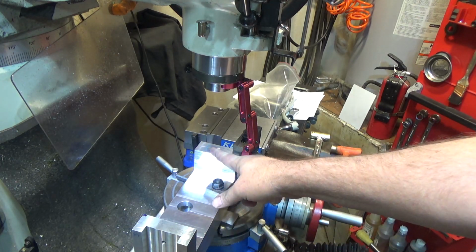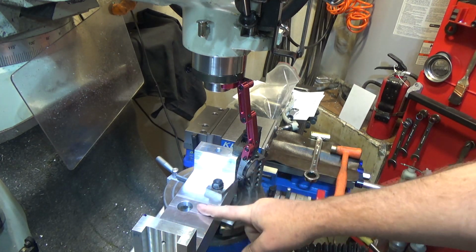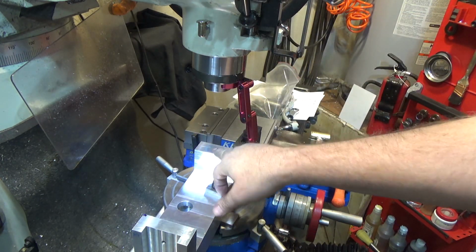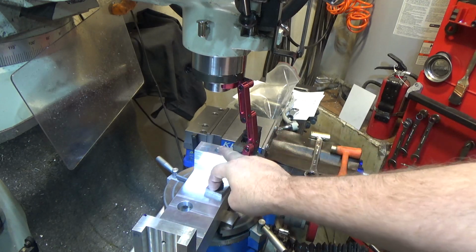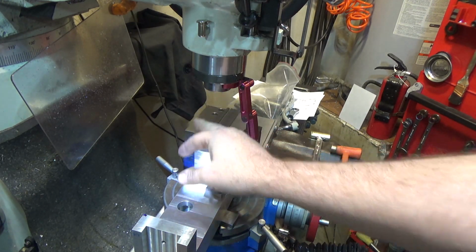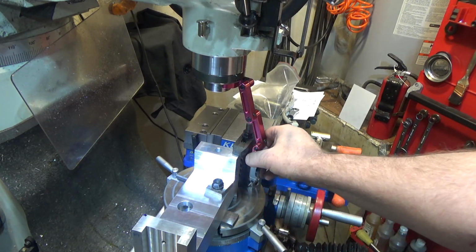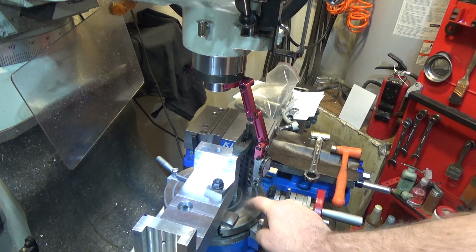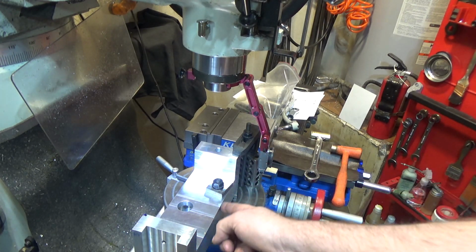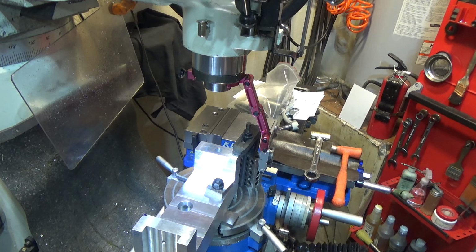It's just for alignment. Then I set this guy on here with that dead center because it's connected to the brass bit, the brass bit that I reamed earlier. So that aligned this whole dead center with the quill dead center. Then I set this at a known angle, and then I indicated this guy in along its entire length. And it required some clamping magic, definitely a little bit out of my comfort zone clamping-wise,